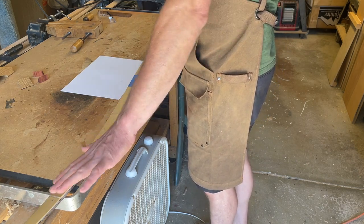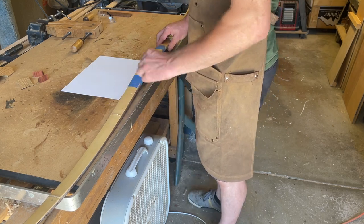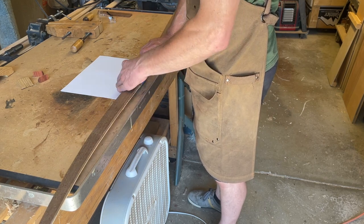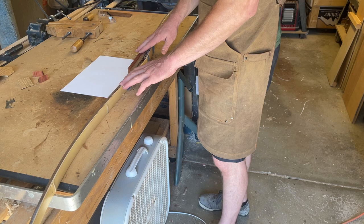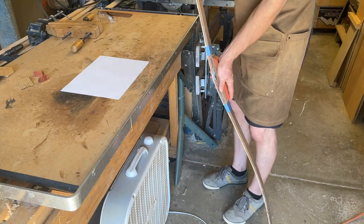We ensured that it's bending evenly across its length in an arc of the circle type of tiller. And we also tapered and pre-tillered our belly. When we did that, we tillered it to a very light resistance. So it's very small dimensionally, and it would bend very easily when we would floor tiller it.